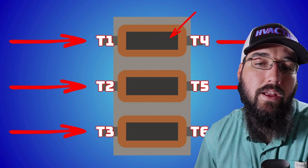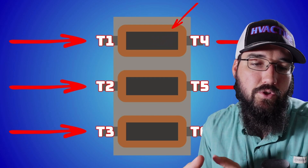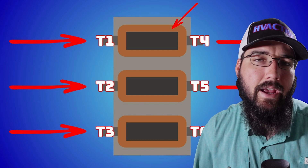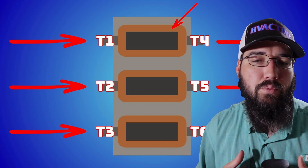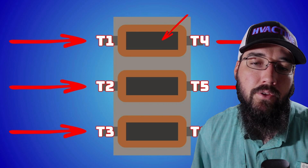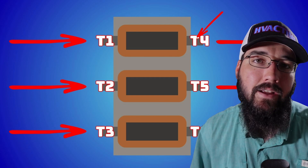So that's part of what happens with line filters — the grid itself could have a lot of static noise or just electrical noise inside of the sine wave and the currents, which can negatively impact a VFD especially. VFDs are very sensitive to these things, affecting their ability to properly perform, function, and their longevity. So the goal is to pass that current through or around these steel cores to take in that extra noise and produce a more clean signal coming out.